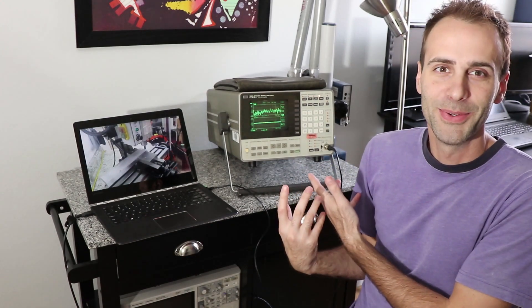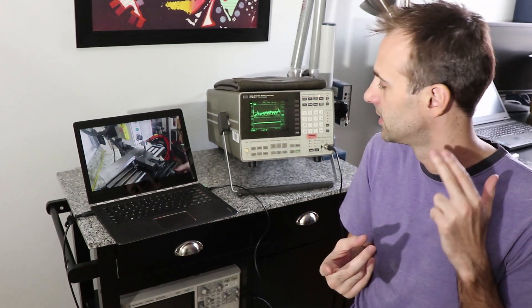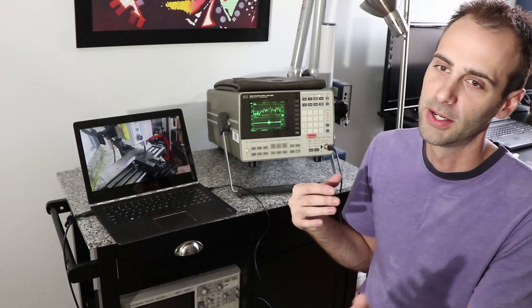What I'd probably want to do — because this is a really cool instrument to play around with in the shop — is get a dedicated microphone and plug it directly into the analyzer. The problem is this thing is so old it has a GPIB card, and saving information in sync with the camera is really tough. Maybe I'll just stick a camera on the analyzer while we're machining. Two key things: get the auto gain completely off with no filtering from the camera or recording device, and optimize the microphone to the target frequency range. An audio mic covers maybe 500 Hz to 20 kHz, but we want to target zero to 500 Hz where the machine noise lives — so maybe even an accelerometer might be best.